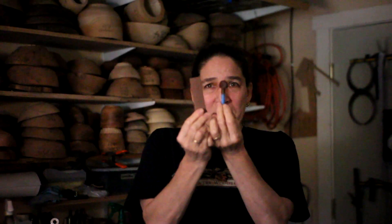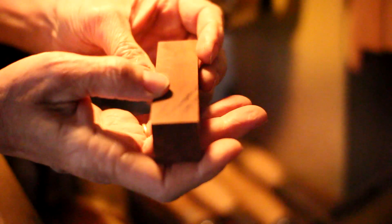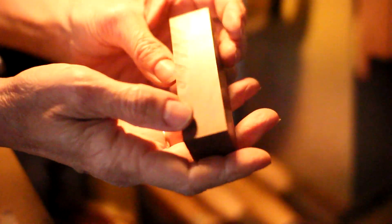I'm making them out of manzanita, which grows locally here and is a wonderful hard, very fine-grained wood. It takes a nice polish and it should last for years and years. These are some little billets — these will get turned into pegs. I start with a little piece of manzanita and what I was looking for is straight grain, no run-out, no knots — and for manzanita, that's lovely.